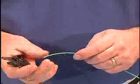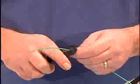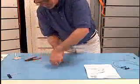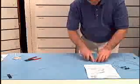Strip off the tube at the 955 millimeter, 37.5 inches mark to expose fibers. Tape each tube onto the work surface, and using alcohol pads or gel cleaner wipes, thoroughly clean all the fibers until the fibers are not stuck together.